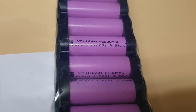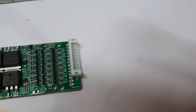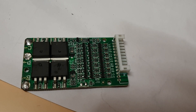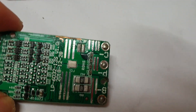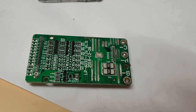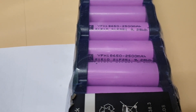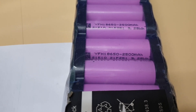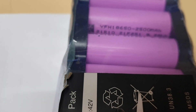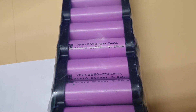Random failure — I think it's probably overloaded with current. The BMS can probably be set to a lower maximum current. Remove one cell and you'll have only half the current. I repaired a few because I got them as job loads — they work after repair, but I'm not sure how long because I only did five cycles on it. I'm not a heavy user but my son is, so we'll know more.